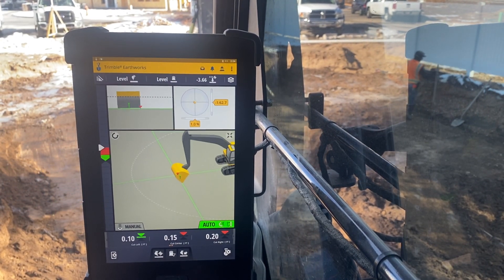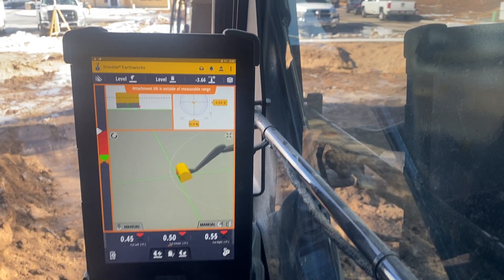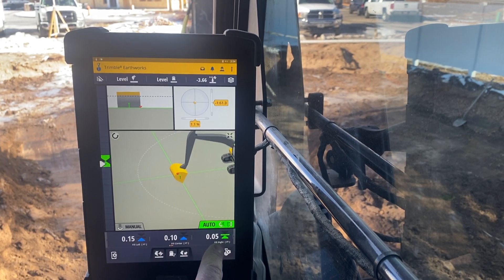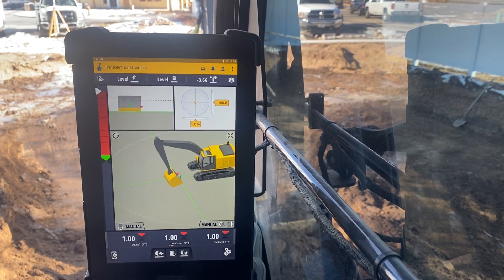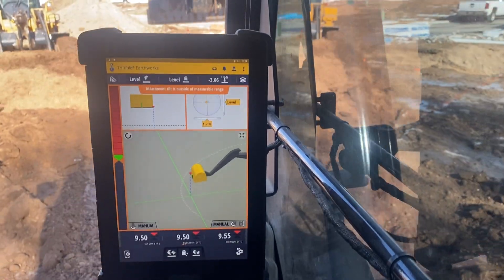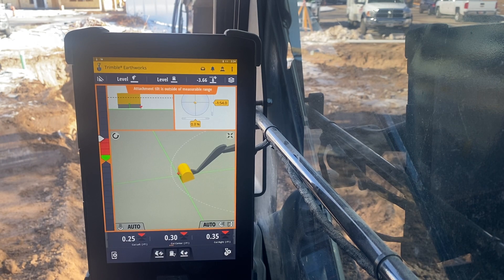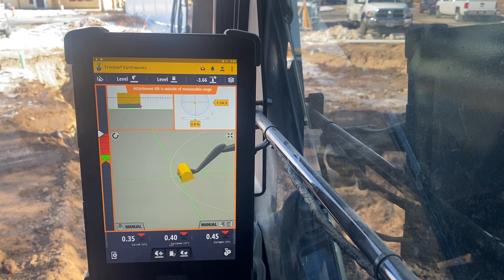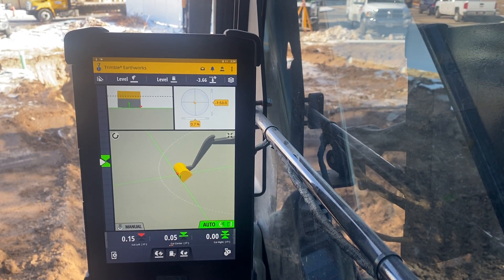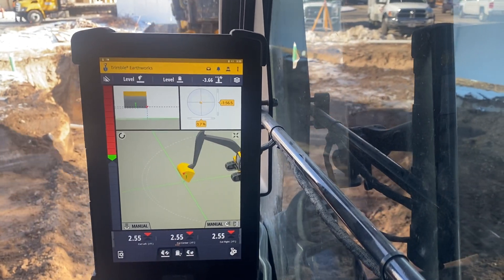You can see it stays a little bit high, so I'm going to go back and touch it up. You can see it's pulling in autos and it's keeping me right close to grade — coming across. Over here I've got to go a little bit more. So that right there was an autos pass. Reaching over, putting it back with a loaded bucket, then coming back. Reaching out — I want to do both of them. It's outside the neutral range, so all I've got to do is roll it in just a little bit until the orange goes away. Then put it in autos — I'm close. I auto both. As I'm coming in it's keeping me on grade.